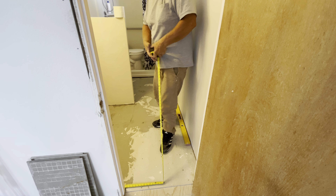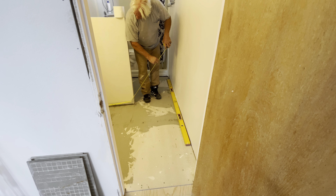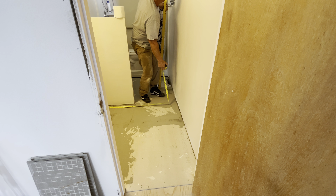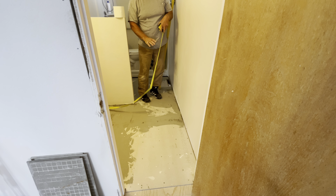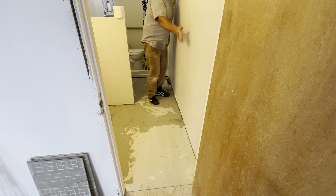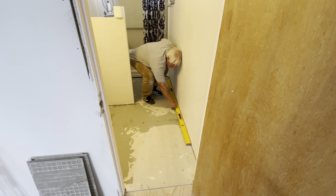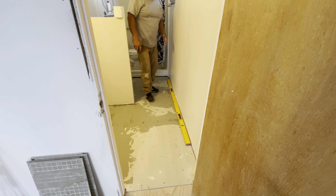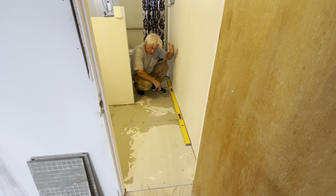I have almost 53 and a half here. You can see by showing you here, it's taken off this way. So you really want to focus staying more in line with this part of the wall. There's a little bit of a bump here. You're going to want to come off the high spot, which is right about here — the high spot in the wall, even though it's vertical. Or the most narrow point, that's where you're going to want to pull off of.